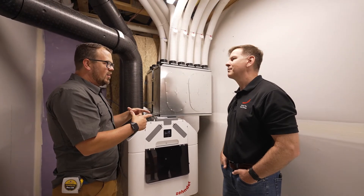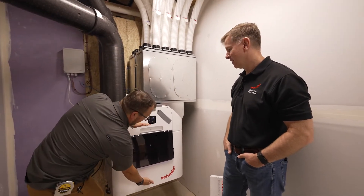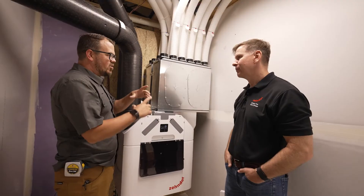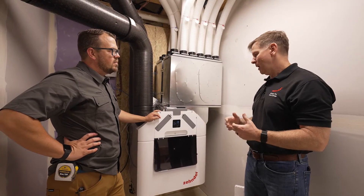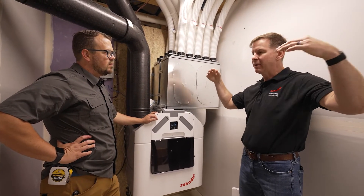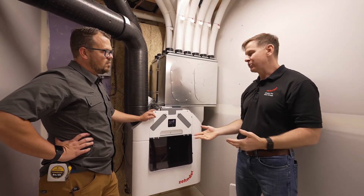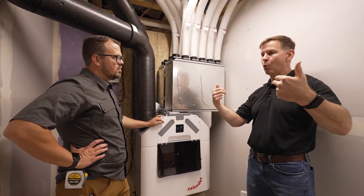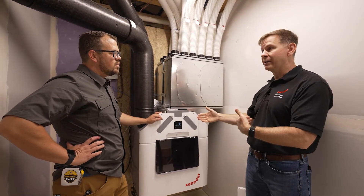The core on ERVs we've used before — my nine-year-old described it as the tesseract from the Marvel movies, just a cube. But this one is an elongated, almost coffin shape, and substantially bigger. The standard diamond or square shape is a cross-flow heat exchanger — they do a nice job — but with a counter-flow, which is that hexagonal shape, instead of just making air cross paths you make the air go head-on towards each other, almost playing chicken. You get counter-flow for a prolonged period of time, resulting in more heat transfer and more humidity transfer, and higher performance recovery.